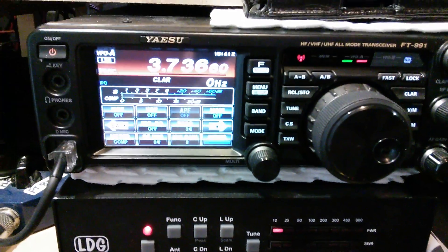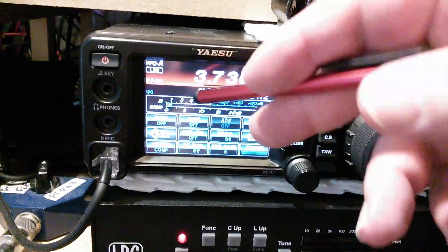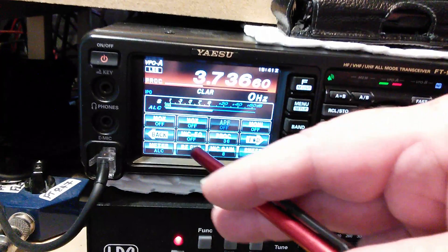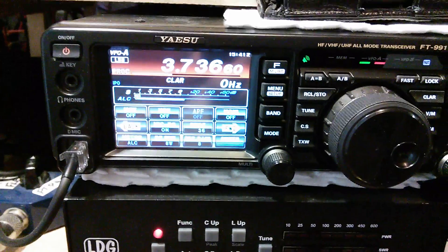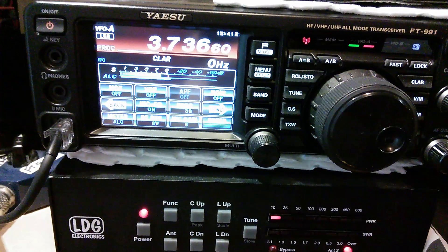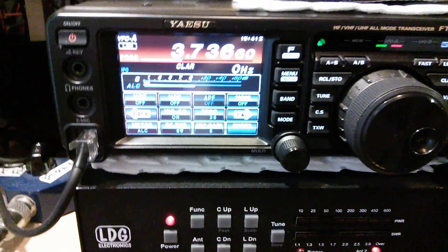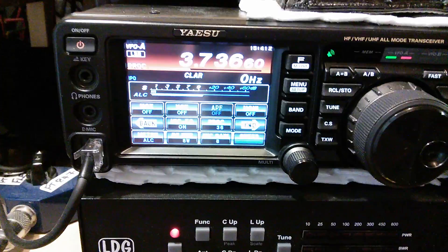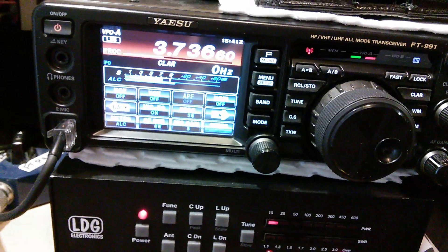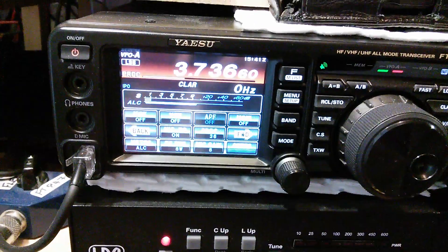1 2 1 2 3 M0AOV, testing with 8 watts M0AOV. So you could see anyway it's up to about 7 or 8. I'll come back onto the ALC and now I'll put my mic EQs on. So now you watch the audio there. M0AOV mic 0 alpha Oscar Victor, test test 1 2 - I'm going to really shout now: audio audio audio - see, that did knock it up into the red but that's me shouting. Normal speech stays roughly around about the 9. It only on peaks every now and again goes into the red.